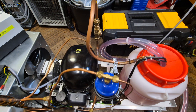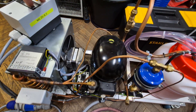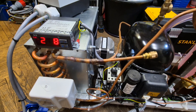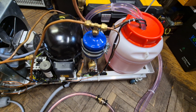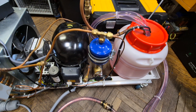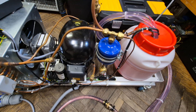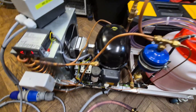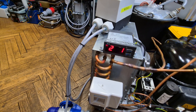Let's turn it on now and let it run for a bit. Once you start it, there's a one-minute on-delay that lets the glycol pre-circulate. If there's any air in the hoses — for example if you just connected it to something — the air will bleed out first, and then about one minute later the compressor will start the cooling cycle.